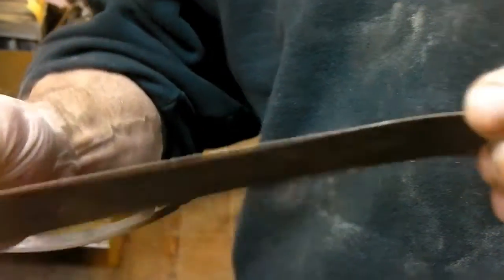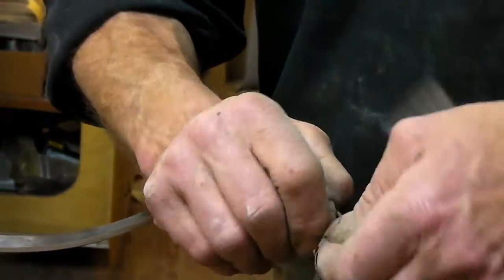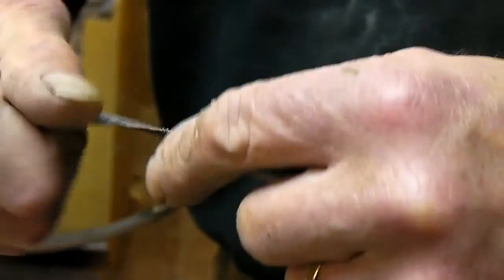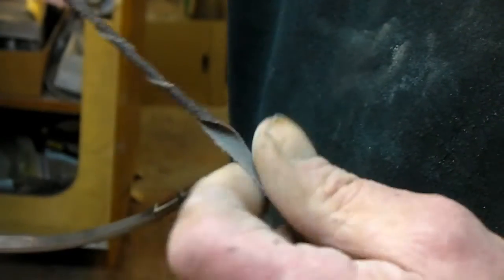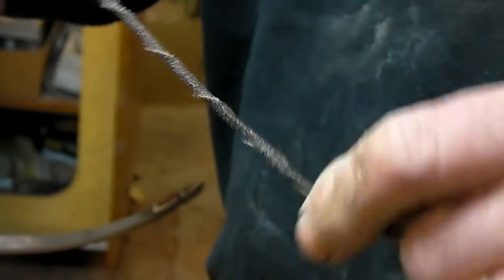I use a cloth. It's an emery cloth. It's got a cloth back, sandpaper. It's about 80 grit. And I take this stuff here, and I just take a strip, about an eighth inch, about quarter inch wide, eighth inch, 3/16, something like that. Okay, and then I just take this thing and I twist it up. Make a rope out of it.